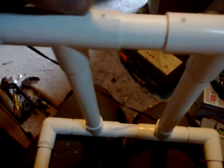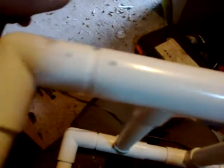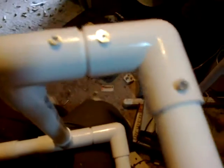Alright, just pre-drilling the holes for the screws with the Dremel. If I screw them straight in, they're going to split it, possibly split it, or they're just going to slip and not bite the plastic. So, pre-drilling them all, screwing them in, and then off to get some black spray paint and some cable ties to get the radios in.